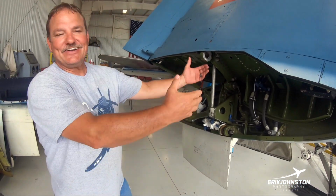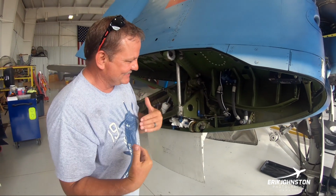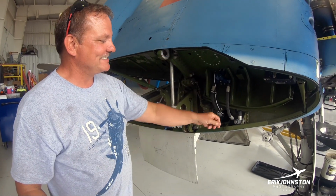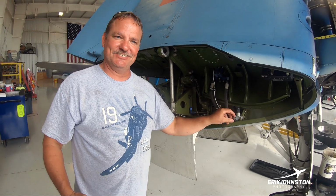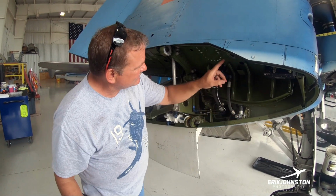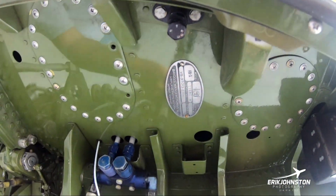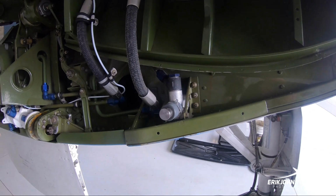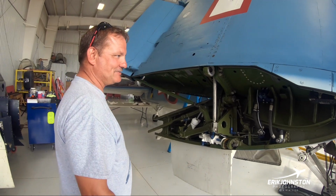As the hydraulics operate and different functions happen, that would be a release valve to say, okay, this part of this function is done. It hits this. See this little stopper right here? So it would come down and contact this and say to the system, okay, hydraulics now bypass this system because it's completed its function. So that's what that's all about.